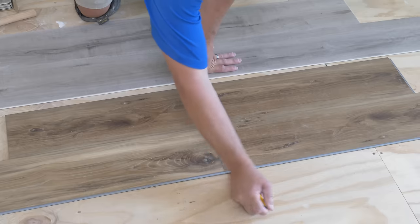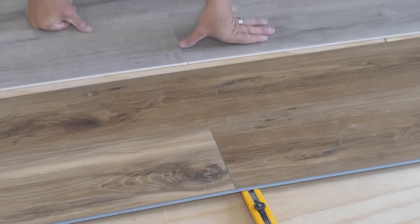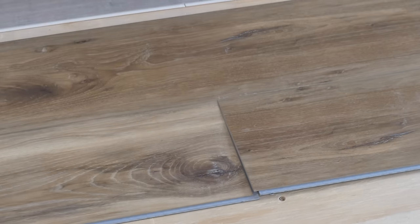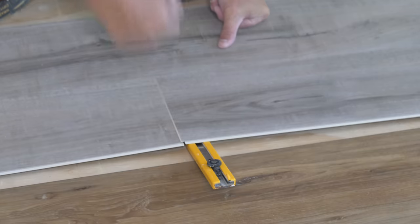Now, watch this. With this one, if you have an uneven surface — I'm going to get my knife under there just to demonstrate the difference. If you have an uneven surface with a void and you walk on it, it pops apart. With the tongue and groove on an uneven surface and you walk on it, there's a little bit of resistance to keep it from opening up.